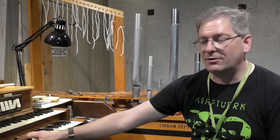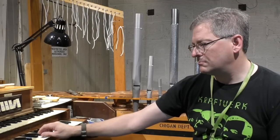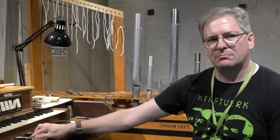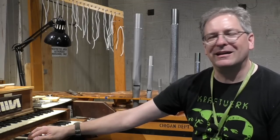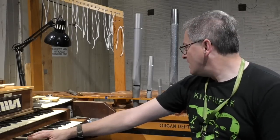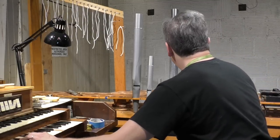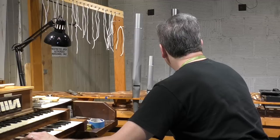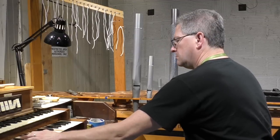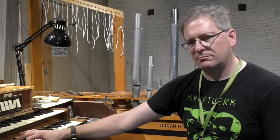So at 5 inches of wind, double languids are going just fine. They're getting louder, but they hang together. The single languids, though, that one's unhappy already. The other two are hanging in there. I might be able to fix that by raising the languid a little bit, maybe. We'll try it. Barely. But the double languids are hanging in there just fine.